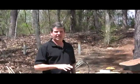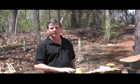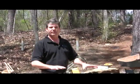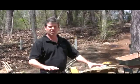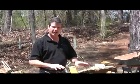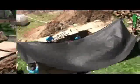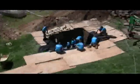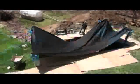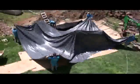The hole has been excavated and we've got our gravel base down there. They've actually compacted it and smoothed it out so that we've got our tolerances right to the bottom of the geotech. After this, we're going to layer our geotech down, put our liner down, and then put our tanks in and cover it up. A second layer of geotech was placed in the bottom of the hole between the liner and the tank modules for added protection.